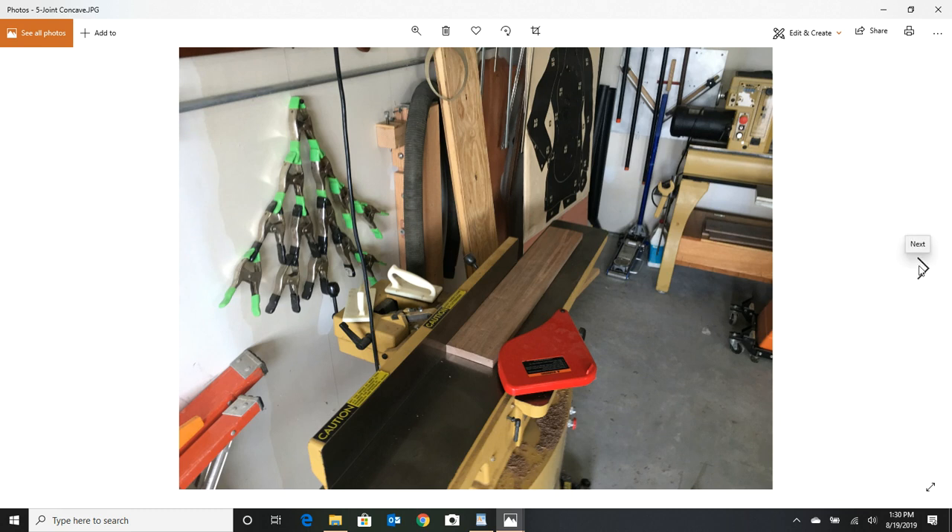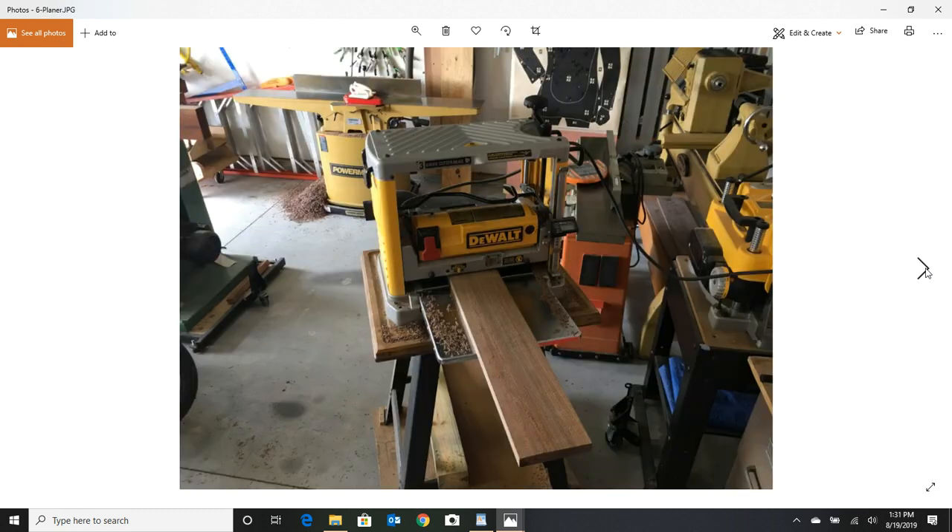There are a lot of steps here — if you're a woodworker, you know you're going to have to run something through the planer or joiner numerous times. Once we got them jointed up one side good and one edge, we put it through our DeWalt planer and knocked it down to size. This lumber was probably almost one inch and we brought it down to about seven eighths by the time we got done joining and planing.